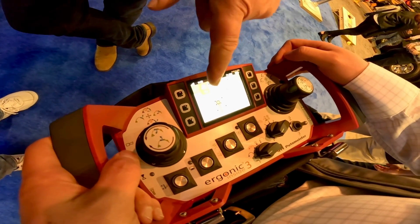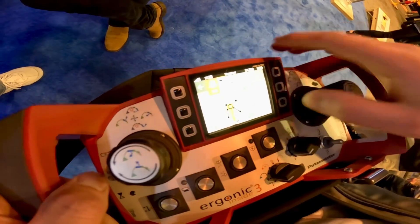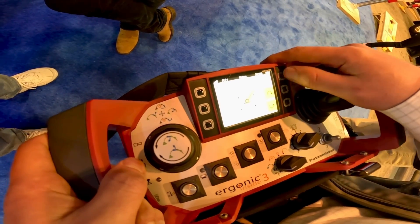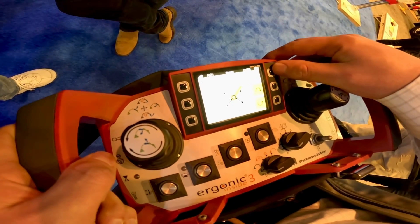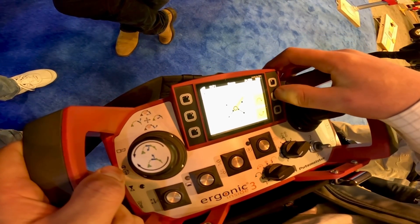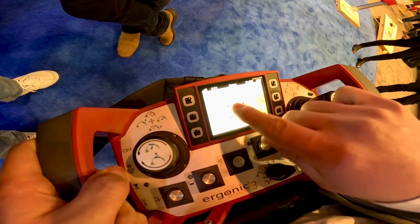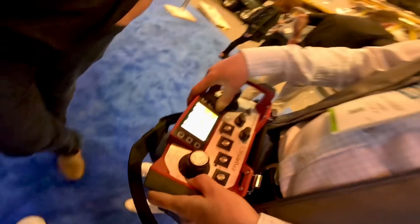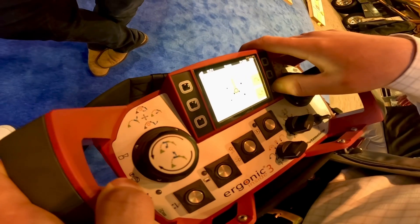In the setup menu it shows the outriggers where they're at. Once it loads you see the working range, and then you can go to that menu to see the range. That's the actual situation of your outriggers. You can turn the boom around and on top of the screen it shows how far it reaches - with full spread of the outriggers you can go full reach.